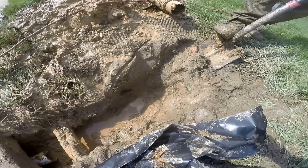The problem is that we need to go through that sidewalk and out to the curb. Ideally, we like to cut the walk and place the pipe under there, and we like to core through the curb, but in this subdivision they won't allow that, so you have to use a pop-up. The pop-up needs to be placed at the curb for proper drainage. So let's take a look at what needs to be done to tunnel a sidewalk.